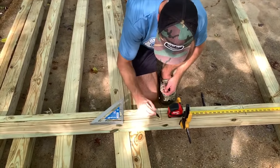Again, we spaced our rafters so that we had 10 and a half inch pieces of blocking in between each, but if you want access to all the plans, check the link in the description. There's always a possibility for a little bit of compounding human error when making measurements, so definitely field verify the distance to make sure that you're not cutting all your blocking to a dimension that's marginally off. Continue to cut all of your blocking, and now we can go ahead and install it.